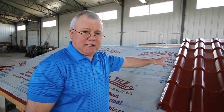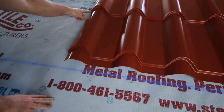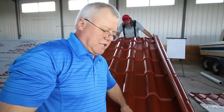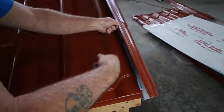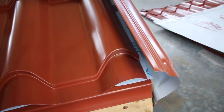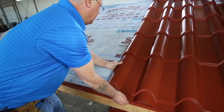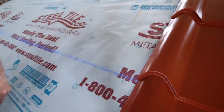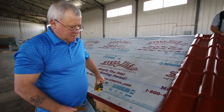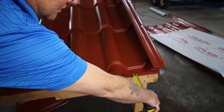Now take your panel — whether it's KTEC Elite or Slate Shake — and place it so the second step lands right on that line. When you've got a round gable on the house, keep the KTEC panel about three quarters of an inch in from your gable fascia. Drop the panel down until the second step is on the line. You'll see the second step is right on that line, which means you'll have three quarters of an inch overhang on the bottom edge.